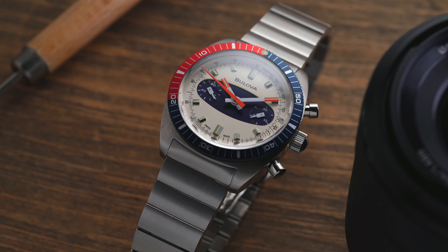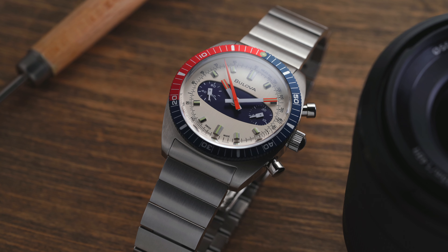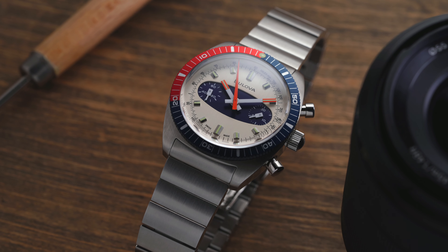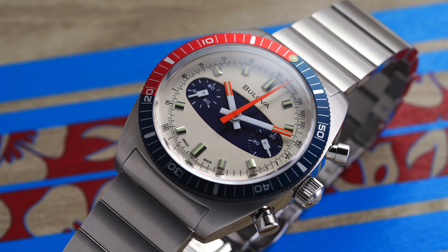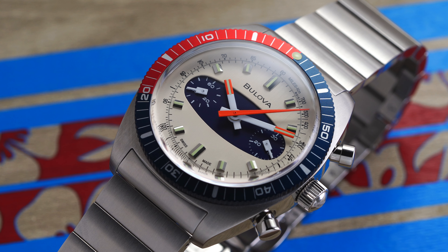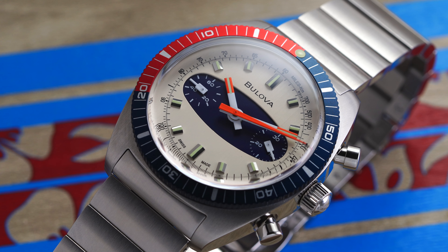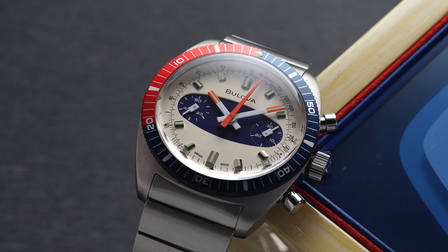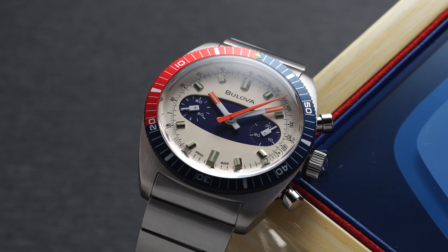Big ups here for Bulova. The rotor jiggle because of the case construction is a little bit less noticeable. If you have ever handled a Valjoux 7750 or 5153, as well as other automatic chronograph calibers, the rotor jiggle in the movement you can feel when it's on the wrist — not saying that this is not prevalent here, but it is much more subdued compared to the competition. Also, when looking at the accuracy of this piece, this one's running quite accurately at about four seconds fast a day. So pretty solid — definitely more of a party in the front, all the business in the back, but that's really what you're looking for when going for a chronograph movement, especially at this price range. You want reliability. You want something that's time tested.